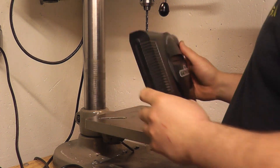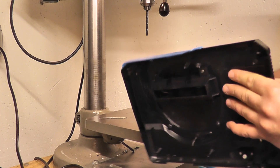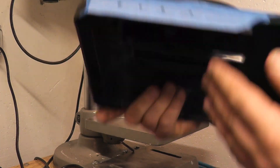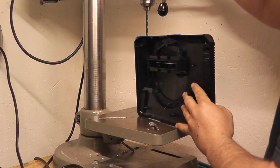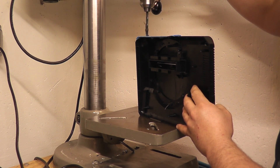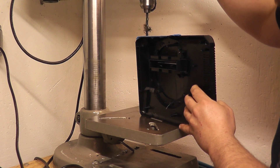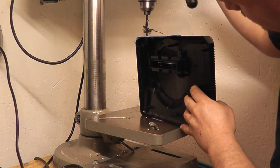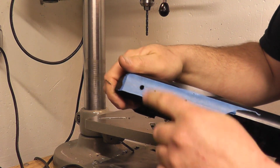So you want to go with the right size drill bit right through. If I do need to round it out a little bit, I won't use a drill bit — I'll take a piece of sandpaper, wrap it around the drill bit, and just ream it out just a hair. I center drilled them first so the drill doesn't wander. Going nice and slow, I can feel it wanting to break through. The tip's through, I just don't want those flutes to grab — and we are completely through.